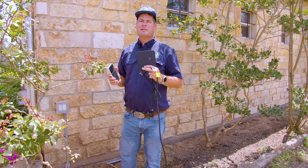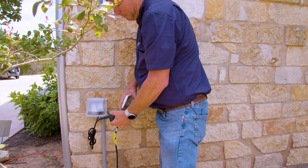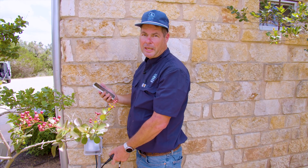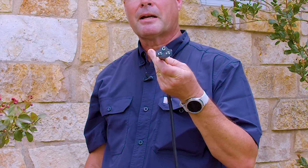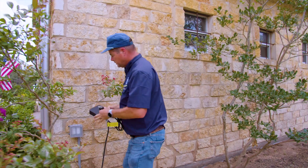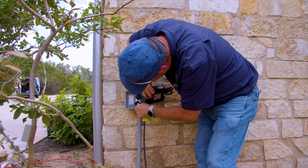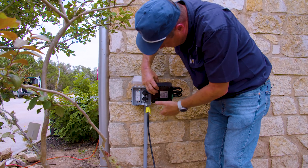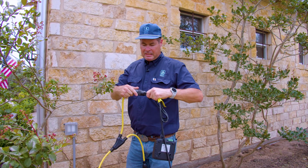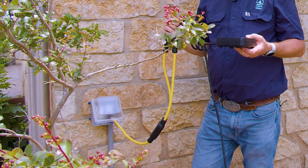If you're installing the EasyBox Diver, you will need the D-Connect 2 box and the D-Connect app on your phone. Plug the D-Connect 2 box in and establish communications with the app. Once established, you will be prompted to plug in the pump. The Diver Series pumps require a NEMA 6 plug for 230 volt, and the D-Connect 2 box is required to be on the same circuit. In the event that only a single NEMA 6 outlet is available, a splitter unit can be used so that both devices can be plugged into the same outlet. Once the unit is programmed, you can remove the Y connector and plug the pump straight into the plug.